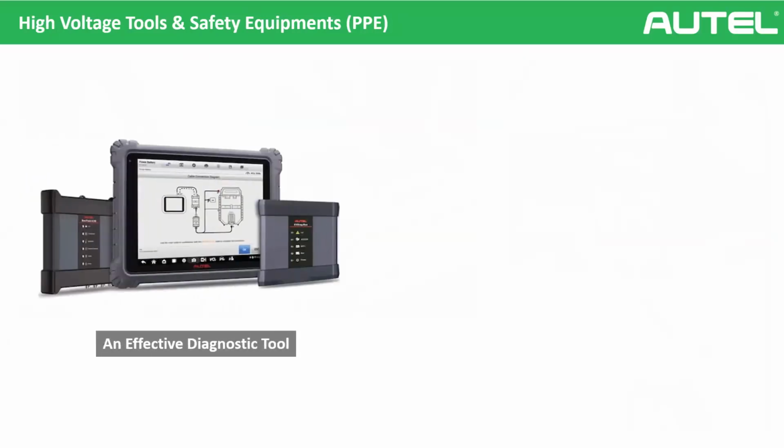We de-energized our car, but we didn't talk about what a workshop needs for specific electric vehicle repair. First of all, a good and comprehensive diagnostic tablet. With this, we will be able to see the cause of errors and ways to solve the issues. We need detailed diagnostic reports and clear live data, and also active tests, not only for the low voltage system, but also for the high voltage system. Okay, after repairing a battery outside of the car, think about it, we need to diagnose it without installing it on the car, for many reasons.